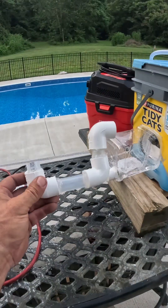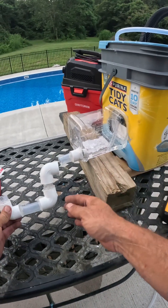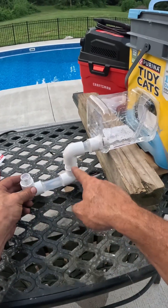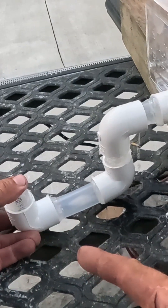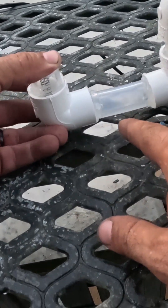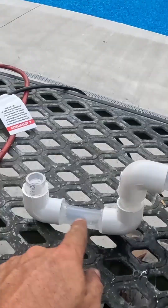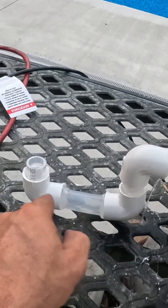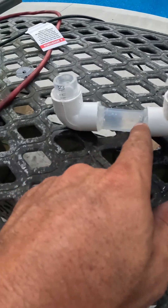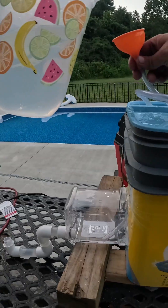So how do we fix that? That's why we put a trap in the system. If we just simply add a trap on there without sealing it we're not really doing anything, because the air is just going through the trap. But if we block the trap off with our thumb we can notice it starts to fill up. We can see we're pulling air through our trap right now — so let's run some more water. Now our trap is solid water.